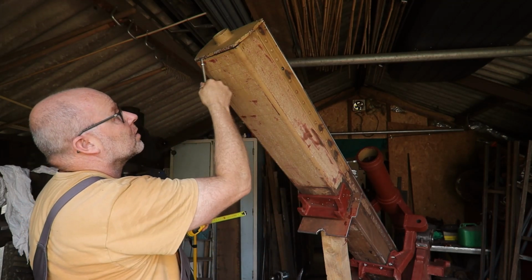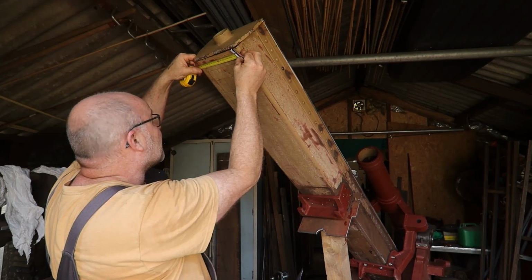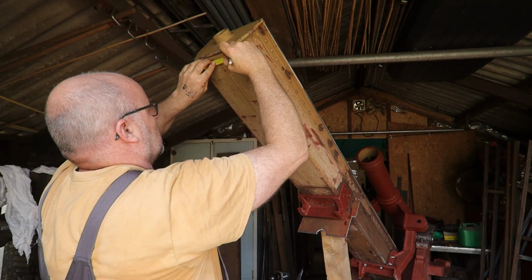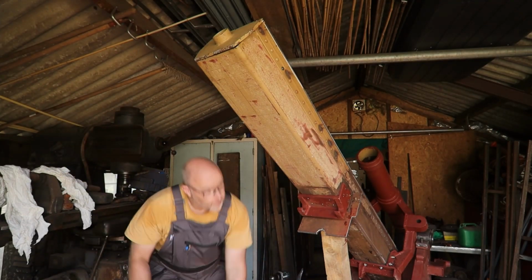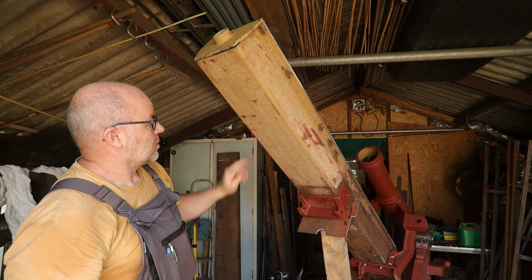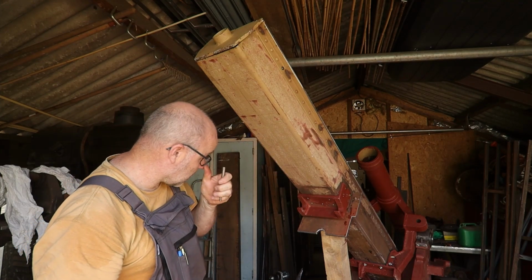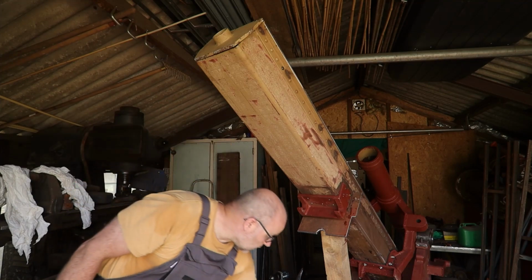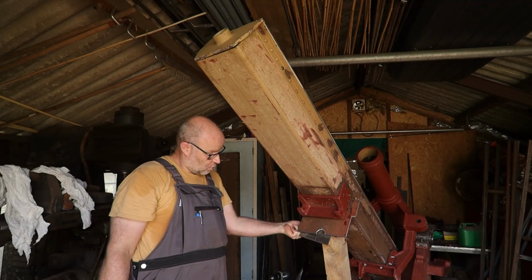Since it's difficult to put a square on here, and this is a bit of an angle, I measure it twice and then put a ruler in between. So it's just beyond this rivet, this plate was replaced. So it might be that there are a few more. I have to check pictures and then I have to drill these holes. It's just in the bracket, but I have to drill through the sled. And then I have to change this angle iron. It's 60, but it needs to be 48. It will go behind here.